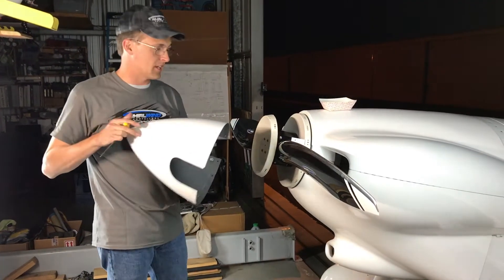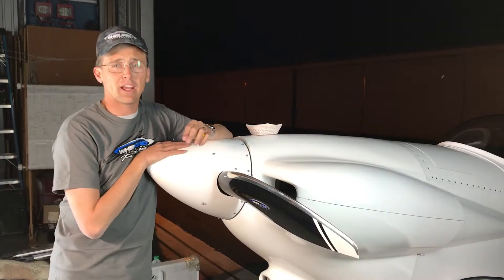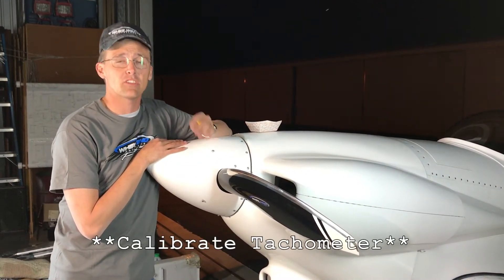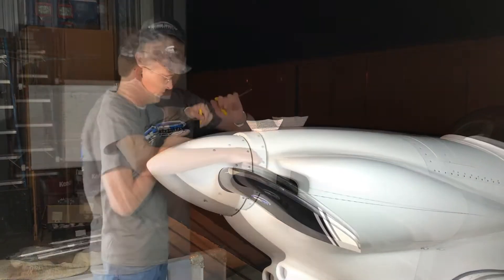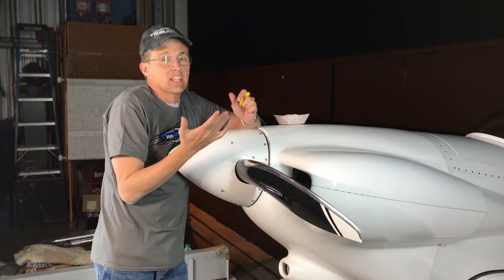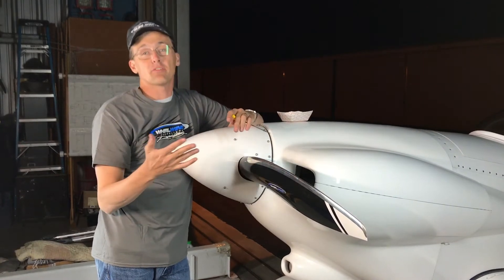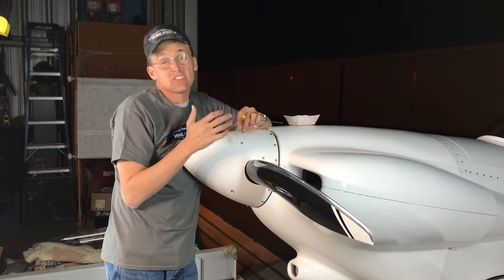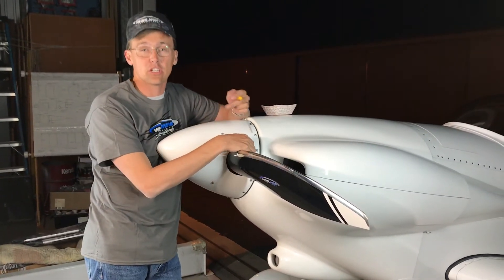Then we just install the spinner. These pitch adjustments are dependent on the tachometer you're using, so make sure you've calibrated your tachometer recently by a trained professional. Today we set the blade angle on this Whirlwind propeller at 26 degrees, which is just a rough guess that works for most RVs. The next step is to go out and fly it — but first, do a full RPM static run-up to see if you're close. You're looking for between 2100 and 2200 RPM to know that you're in the ballpark.